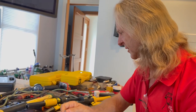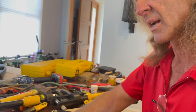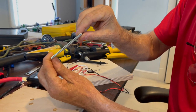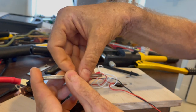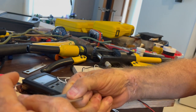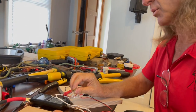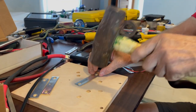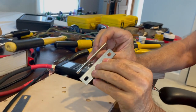While we're on the subject of bus bars, this is kind of a painful subject. These bus bars don't show up flat. There's a gap, and what that means is where that bus bar meets the terminal, it's not sitting flat on there. You are not going to pull that out by tightening up the bolt unless it's really minor — it takes more strength than that. So the first thing I do when I start working with these bus bars is I flatten them.